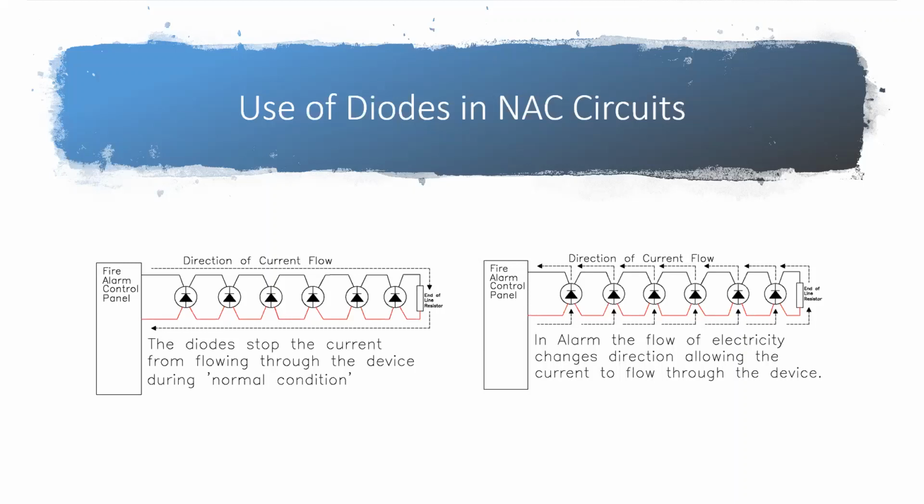So when I'm doing our plans here at the office and I'm putting together our design and I'm drawing out the circuits, I'm taking all the different factors into account, like how much wire is between devices, so that we get how long the run is, how many devices are on the circuit, and what candela settings, which is what load each device takes. All of that comes together to create our voltage drop calculations. I put a page of that into each of our submittals. It's a big giant table. I don't know how many ever take the time to look at that or try to understand it, but it's a table that I put on one of our drawing pages.